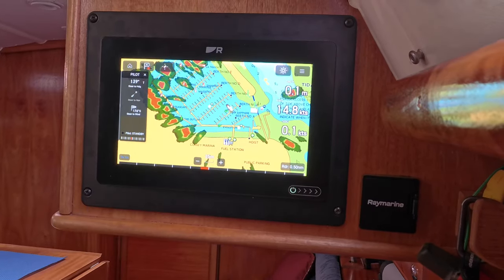There's one more thing I love — if you've got an iPad or mobile device you can control everything on this screen through your device using the Raymarine app. You just need your device on the same Wi-Fi as the chart plotter. There's a slight delay sometimes, but I can look at all the information, set an anchor, check the anchor alarm — there's nothing I can't do on the iPad that I can do on that screen. It means I can run this system from bed — just have the iPad by your side and keep an eye on things and make changes. I think that is absolutely superb.